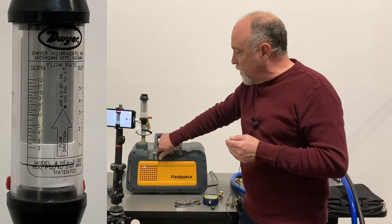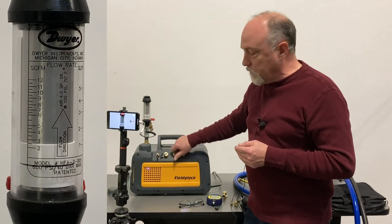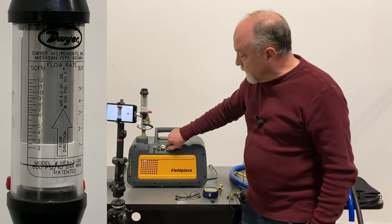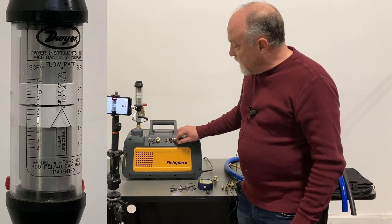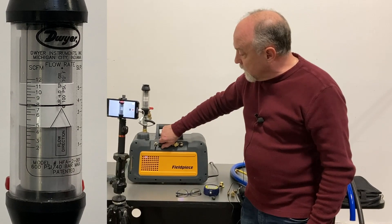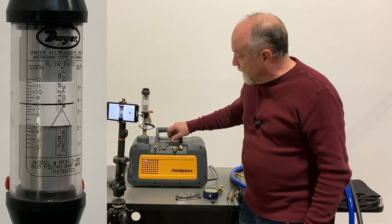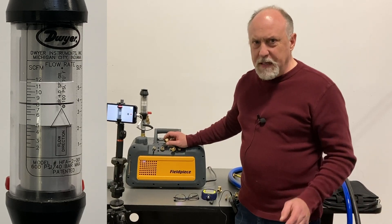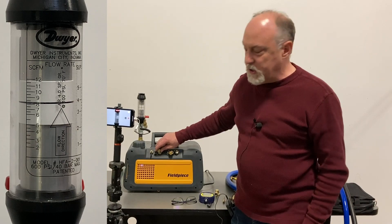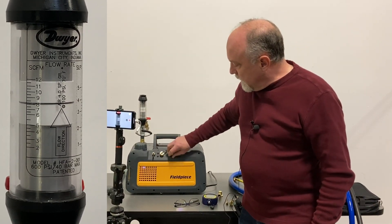When you're thinking about what size hose to connect — you saw that this half-inch port pulls a full 8 CFM. If I go with a 3/8 port, you can see it's also about a little bit under 8 CFM. And if I open this up fully it goes up just a tiny bit, but not too much more — even with two ports open. If I open a third or fourth, there's going to be no change.